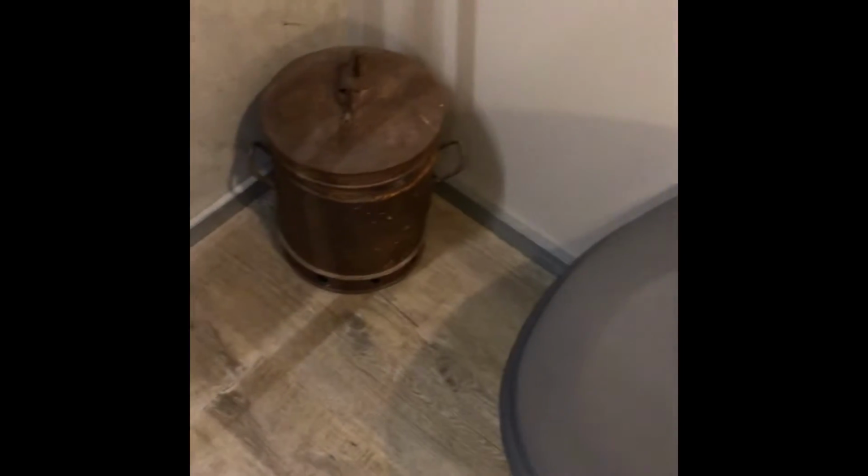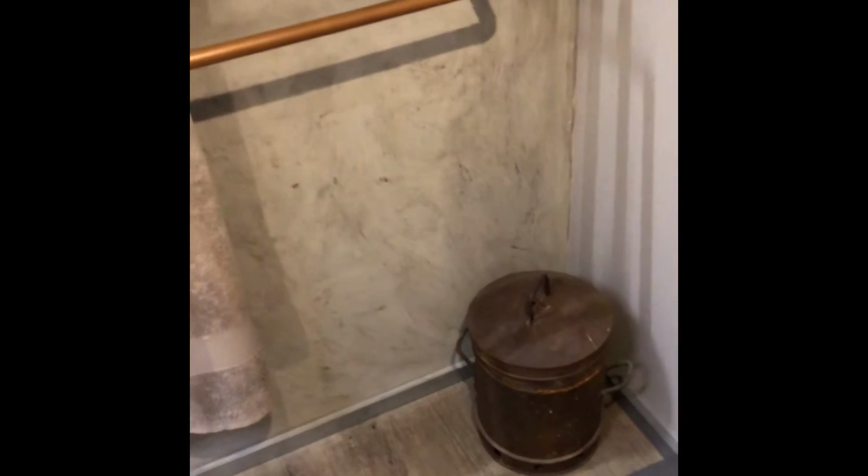All the skirting board here, or the edging at the bottom of the wall, I don't know if you can see this. This is actually metal rails, which is what's used in putting up plasterboard or drywall. I had some left over that a friend gave me from another job, but it's cheap to buy anyway. They come in great big long 3-4 metre lengths, and I just cut them to length, screwed them on the wall, and you've got this industrial metal galvanised looking skirting board, which just works great.